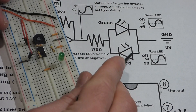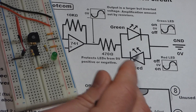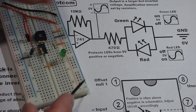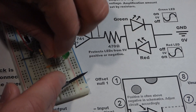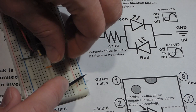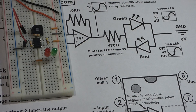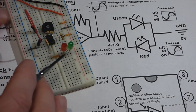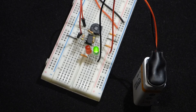The red LED is wired the opposite way — short lead toward the output, long lead toward ground — so it conducts when the output is negative. The brightness of the LEDs will also give us a rough idea of the amount of current flowing.